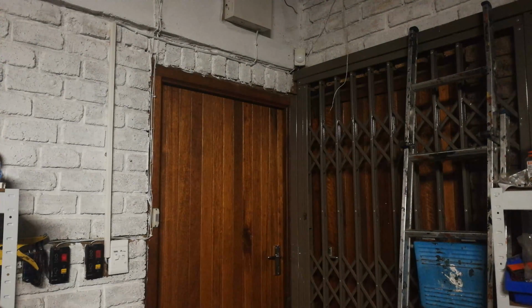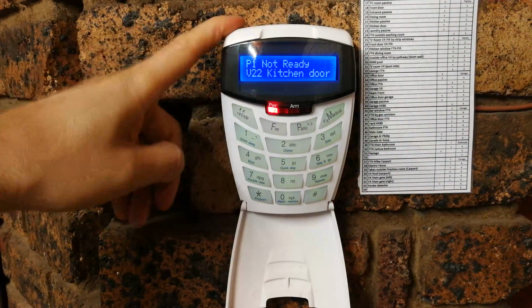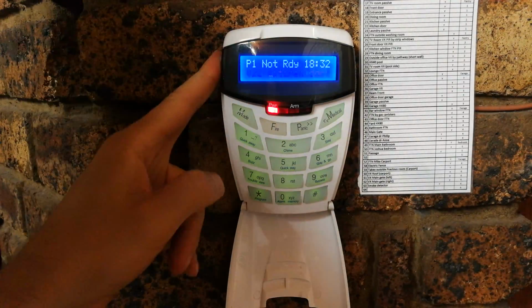So if you are going to use a standard indoor sensor in a garage, make sure to adjust that pulse count, because you will get a lot of false alarms in the garage. And as you know, the garage does often get rats and mice, especially through the night, because there's no movement in the garage. Therefore, I recommend that if you do install a regular PIR in a garage, set the pulse count a bit higher. Preferably use a microwave or a sensor that is actually geared for this type of environment, a roof or a garage.